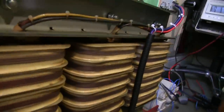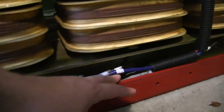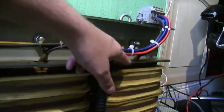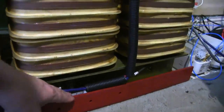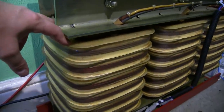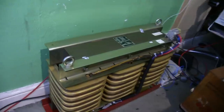To do that we use just two coils. We break this star point — these were all joined up at one point, all of these. You had a phase in the top, middle and the end — there were your three phases in. This is called the star point. So broken into that, there's a neutral on one, live on the other. These two coils are wired up in opposition. This one's redundant but we can still use the secondaries on the other side. It's quite a nice transformer — that won't burn out in five minutes.